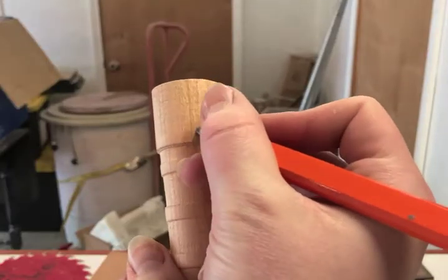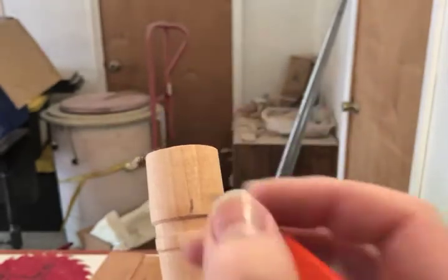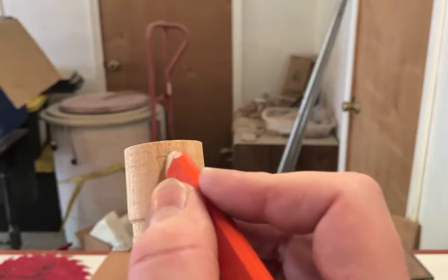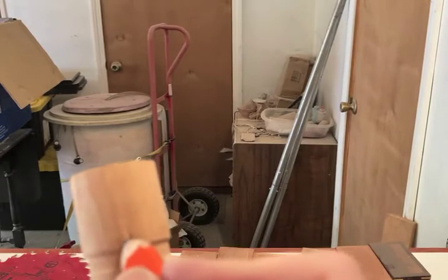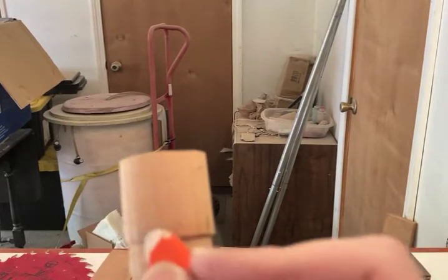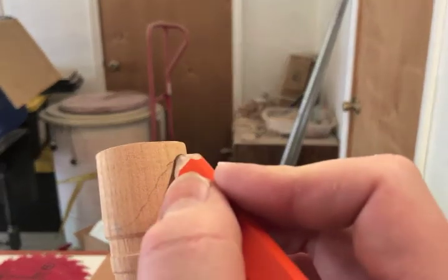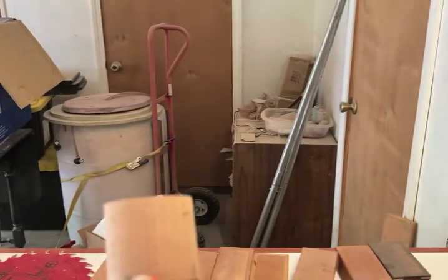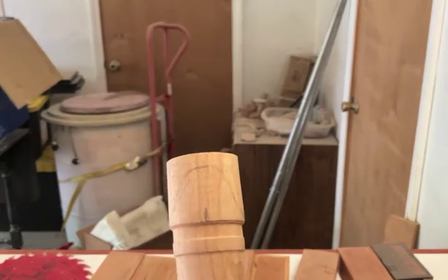Now for the fun part. We're going to carve up this pommel. I'm going to mark out 4 evenly spaced lines up there, and copy those lines on opposite faces. The shape has these kind of U shapes that go all around. You'll see it when it all comes together. But to do that, I'm just going to draw an S connecting those 2 marks. And because I'm doing it this way, I can see that it's symmetrical on each side. Yeah, you know, that shape.